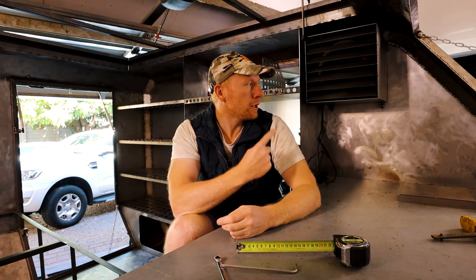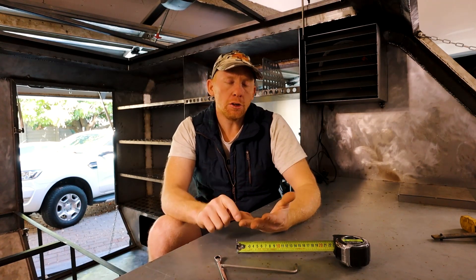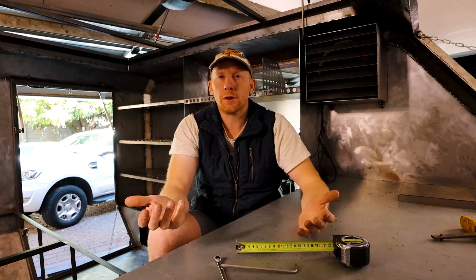The reason for going with the fan is twofold. Firstly, I get to filter all the air coming into the cabin by sucking it through an engine air filter. And secondly, I've got an idea for an attachment to attach to this assembly which will transform it into an evaporative cooler. So not only do I get to keep the dust out while I'm busy towing, I also get cool air when I'm at my destination, which is a huge bonus to me.